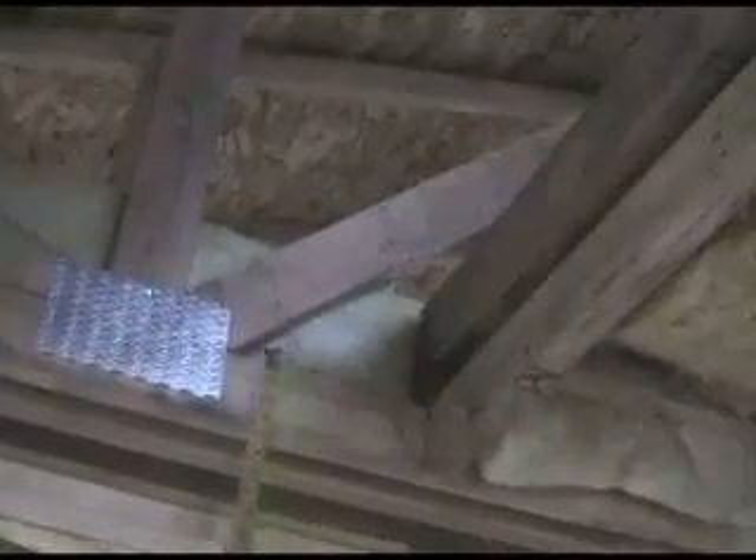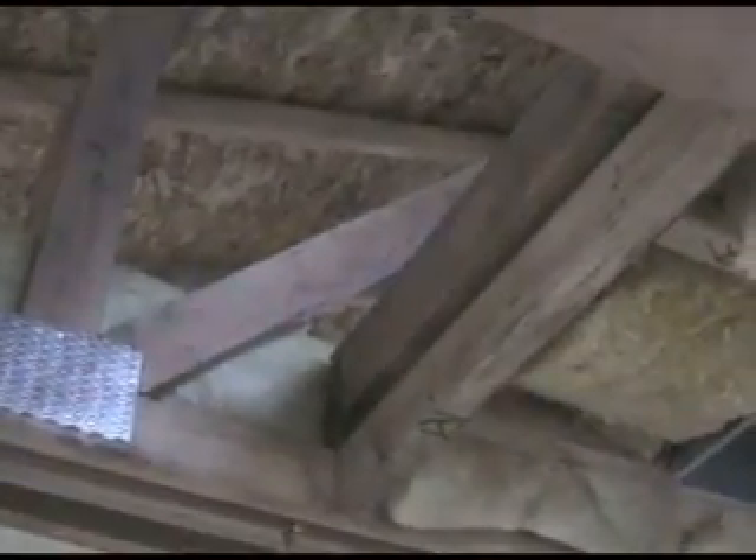Once this is all drywalled in, typically they put up a piece of drywall or a piece of plywood, which will be the attic access cover. Not only does the insulation need to be the same R-value as the attic — R-30 in this case — it needs to be permanently attached to the attic access cover, and it also needs to have foam. So it needs to be sealed off with foam or some other mechanism to make sure that there's no infiltration through the attic access into the attic space.